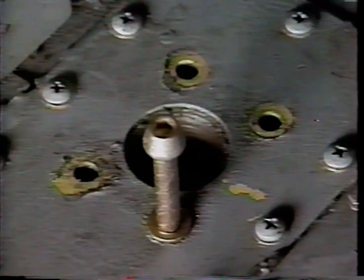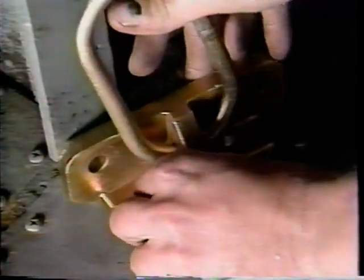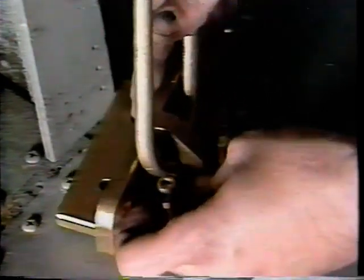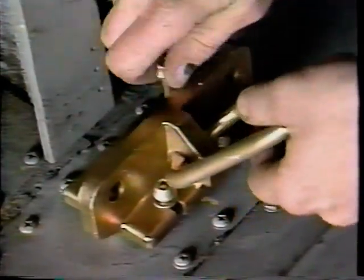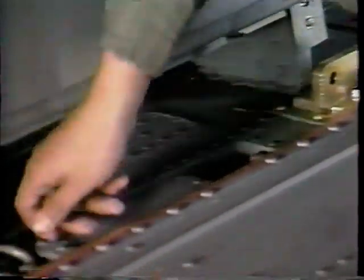Install a second internal wrenching bolt and washer finger tight — it must also be inboard. Slide the 10K fitting assembly casting into position. Insert two outboard 12-point bolts and washers and tighten. After you have installed all eight 10K fitting assemblies, ensure that the 10K fitting assembly rings are laying parallel to the aircraft and no 5K fitting assembly rings are facing outboard before rail installation.